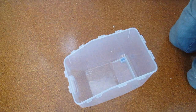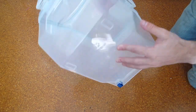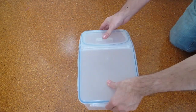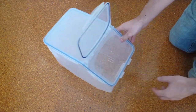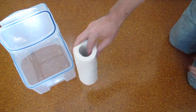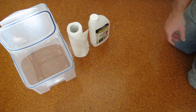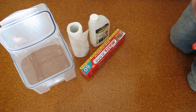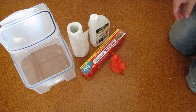Here's what you'll need. First is a container, airtight and acetone resistant — this one is made from polypropylene, but polyethylene, HDPE, glass, or ceramic are great choices as well. Make sure it's large enough to vapor finish the models you want and that it seals really well. You'll also need some paper towels, acetone of course, some aluminum foil, and something to vapor finish — it needs to be printed from ABS plastic.